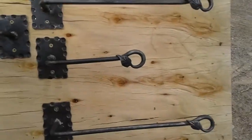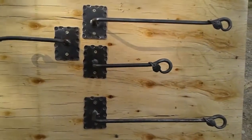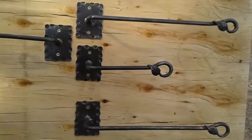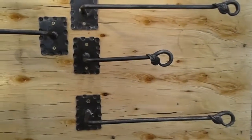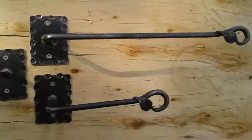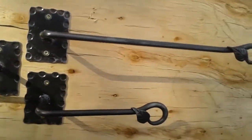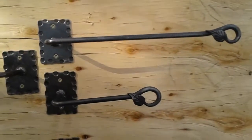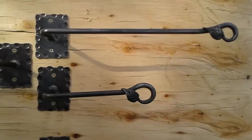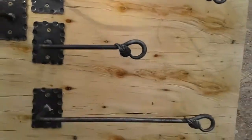The top three have a coating of linseed oil thinned just a little bit with some turpentine. Out here where we have very low humidity and it's 90 degrees today, it dries in a couple hours — good enough that you could hang something on it. It makes a nice finish, it's pretty durable, and it works pretty good as a rust preventative. In a bathroom situation, I'd probably use a urethane.